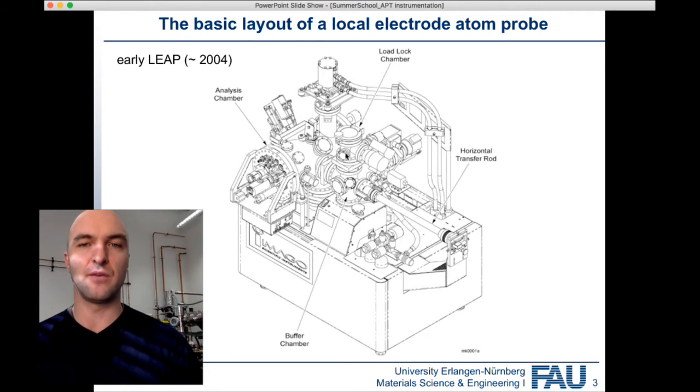The main reason for the buffer chamber is that unlike a high-vacuum system such as a normal transmission electron microscope, it takes a while for contaminants — mostly water vapor stuck to your sample — to come off. As soon as you take something into atmosphere, you get a monolayer of water vapor on it, and that comes off very slowly. So we need to pump down for quite a while. Three hours is the absolute minimum, but pumping down overnight is highly recommended.